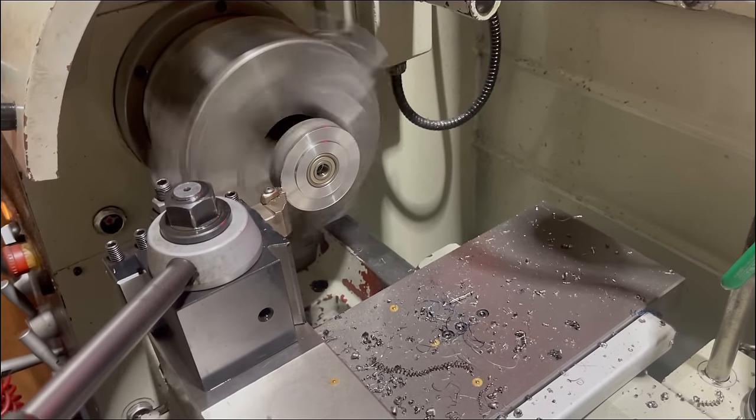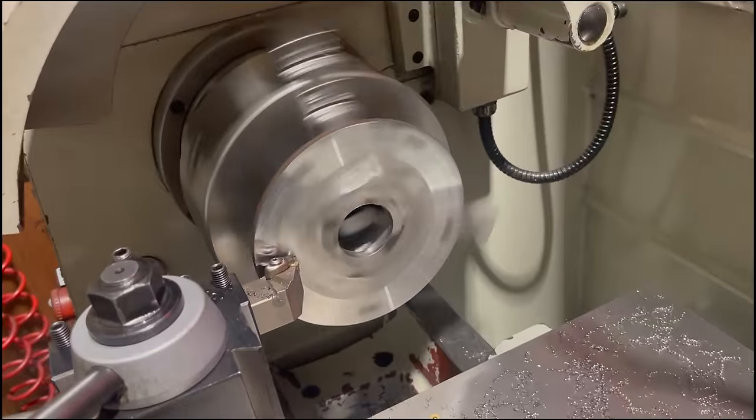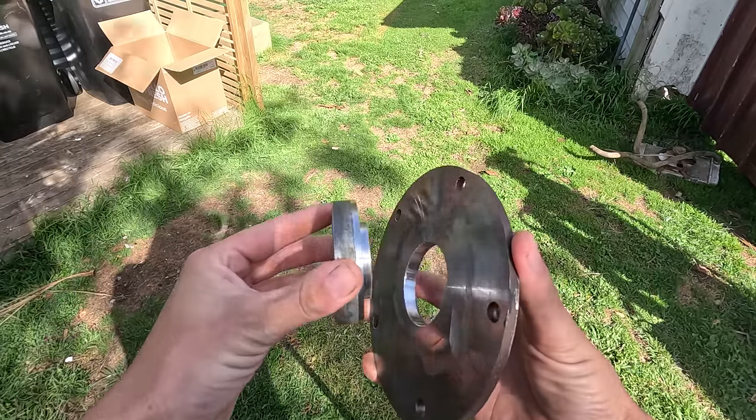I need to make a freewheel sprocket, so I machine down this roller. Then I threw up the sprocket carrier, which I cut off the old setup, then bore it out to fit the roller.